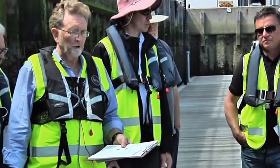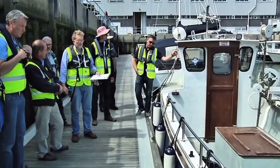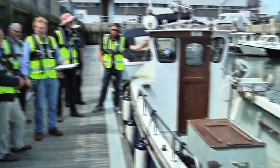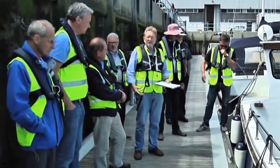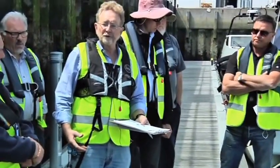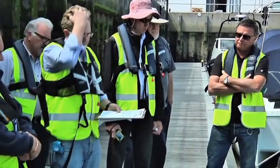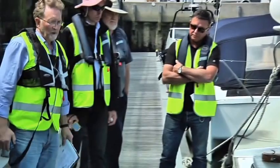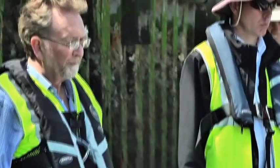And when you come along to the boat at the 5-year renewal, if you know what the freeboard was empty, like that, no people on board, you can easily check that. If you only know what it was with the 6 or 10 or 14 people on board, and you haven't got 6 or 10 or 14 people available at the 5-year renewal, it's not going to be so easy to do the check. So you're talking about the lowest freeboard.